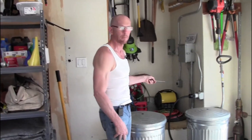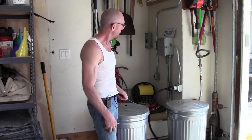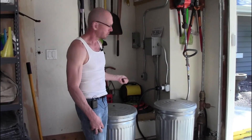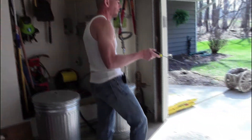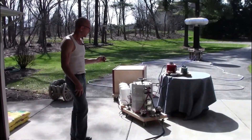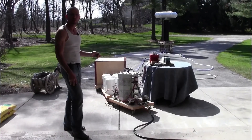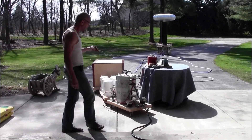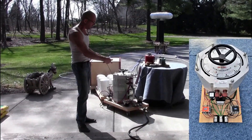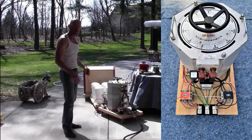The whole thing starts in this area. This is what I like to call the umbilical cord — it's a 240-volt fused dedicated outlet which comes out of the basement and is rated at 100 amps. From here it goes to the first stop: the power variac, rated at 20 kVA, activated by two contactors each taking one pole of the phase legs to make continuity to the transformer inside.